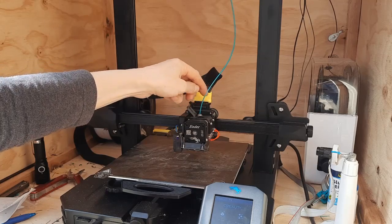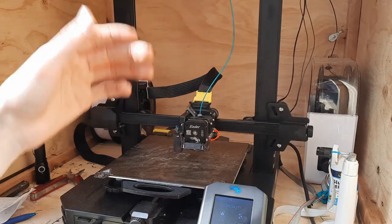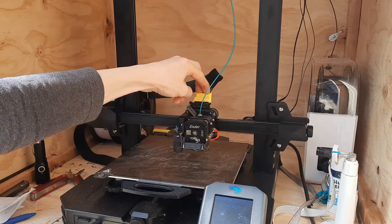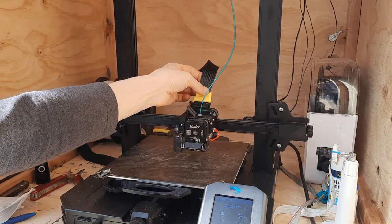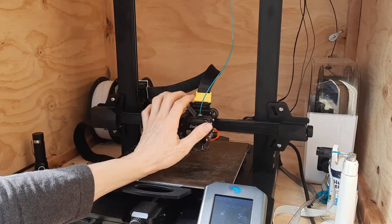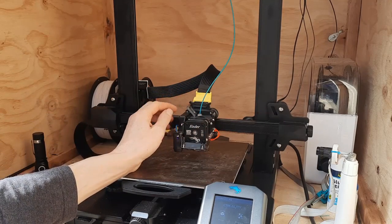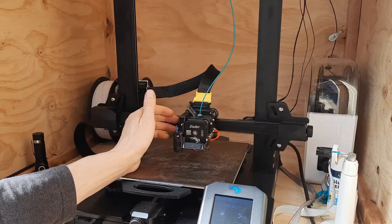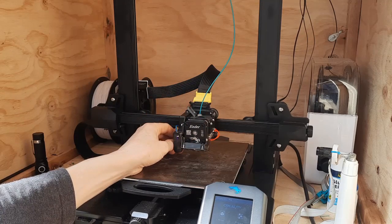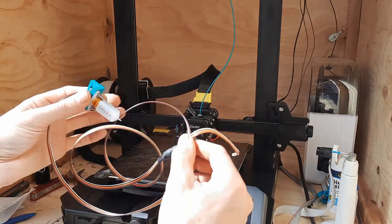It's two millimeter spacing, 12 by 12 pins. I ordered one, but I worked out a better way for now rather than getting a pack of 10 from AliExpress for five bucks - that's still problematic because you've got all the other pins exposed and you have to make sure they're all insulated. There's risk of hooking up the wrong pins or them shorting on something.